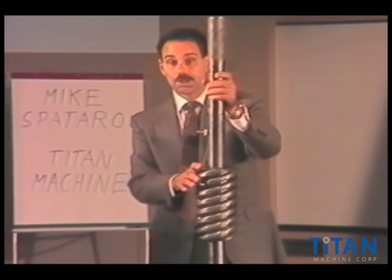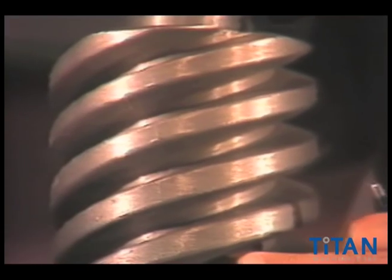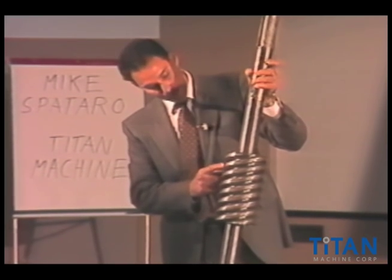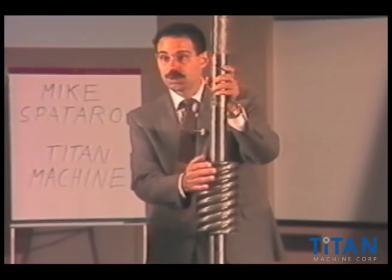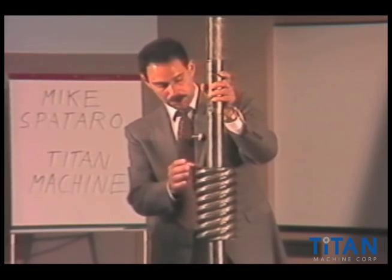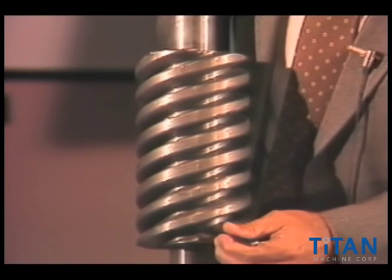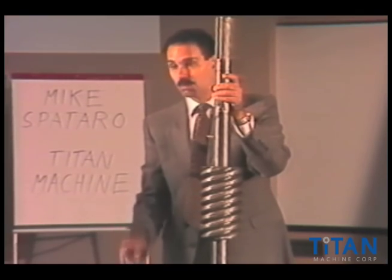This is the one I was talking about with undercutting. This was a poor job of undercutting — you can see all kinds of chatter marks. This was done on just a regular engine lathe, and it shattered it up so much and made those worm teeth so bad that it couldn't operate properly. But it can be used as a demonstration to show what undercutting is — they turn off the OD, undercut on the inside, and drop the gear teeth in a little further so you have more clearance.